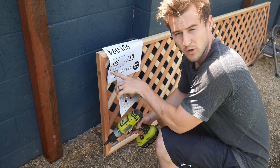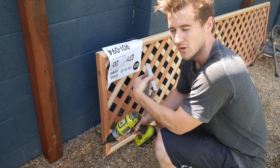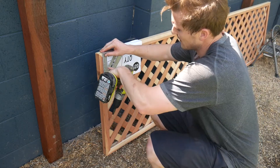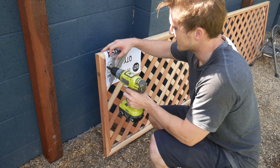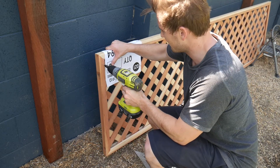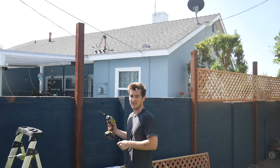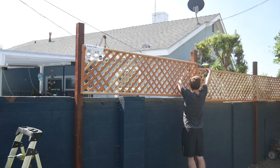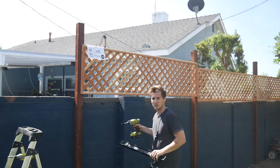One additional thing: this is redwood and it's pretty soft. I did a test off camera and found that the wood was splitting when I didn't pre-drill. So I'm using my speed square with each lattice piece, measuring two inches down — that's an arbitrary number, you can do it wherever you want — just doing it at two inches for consistency, then marking and pre-drilling the hole. I also pre-drill the screws into the redwood lattice so when I get it mounted I can quickly drive it into the post. Every time I get one side mounted, I go to the other side, check for level, and drill in the last screw.